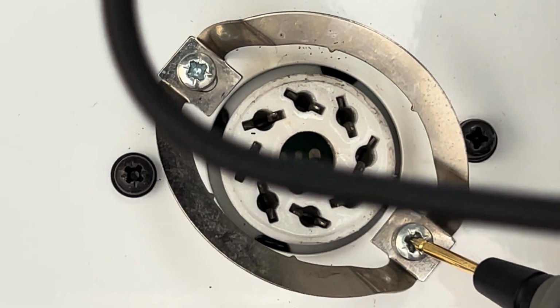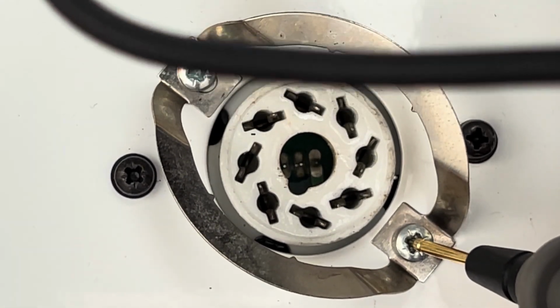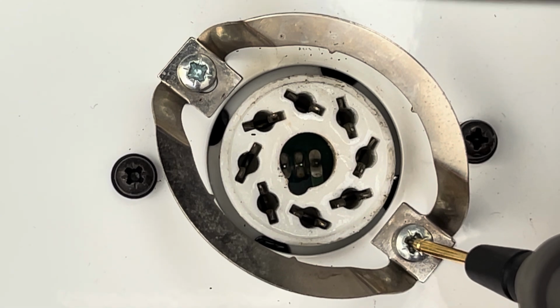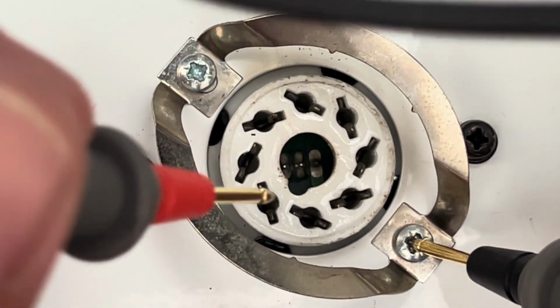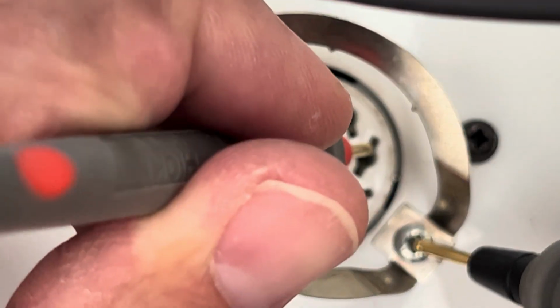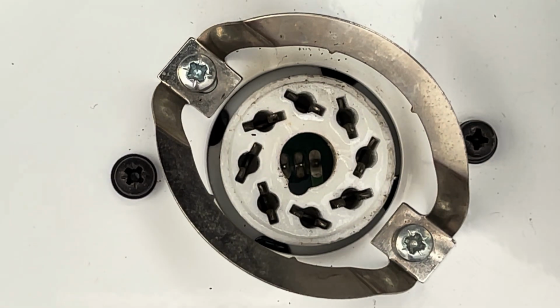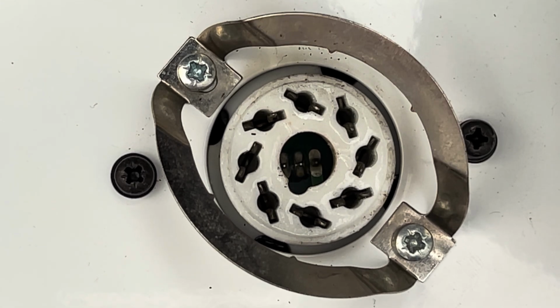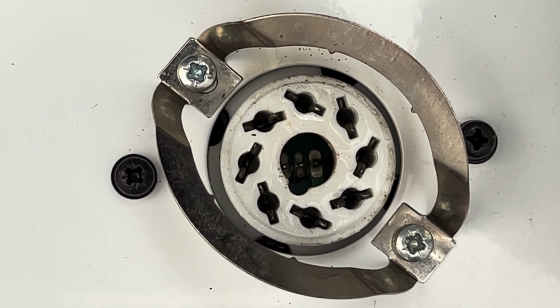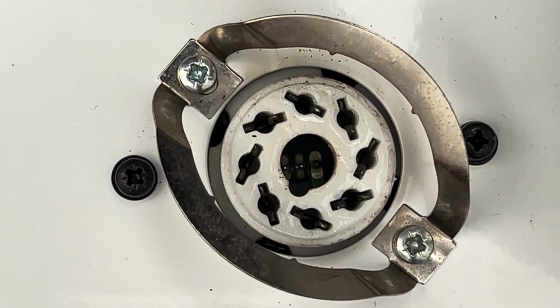All right, these are some very unhappy tube sockets. Let's get a good retention here. Let's see how much voltage we have left. I don't need to electrocute myself today. And you're going counterclockwise on these pins here. So we're going to look at pins 3 and 4. About 1.1 volts each. So we're good to proceed with the retention. And why wouldn't we be?